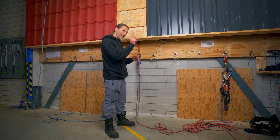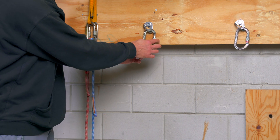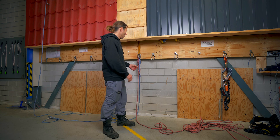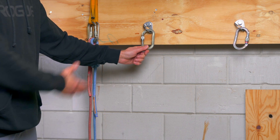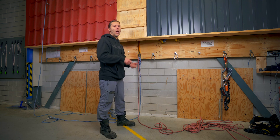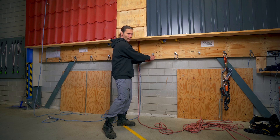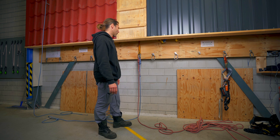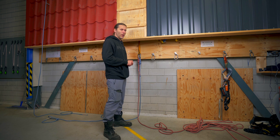Another best practice — a little point of attention — is that we try to put our carabiner in such a way that when I lock it, the screw goes down, so down with gravity. If the wind is vibrating the rope, it does not unscrew, because if it goes the other way, in a few minutes it's going to be open. Now, when you're running airlines or high-water-pressure hoses through the carabiner, you will see that the screw gate will be going up and down when the water is running through. In those instances, you have to do a risk assessment and maybe decide to use tri-act three-way lock carabiners.